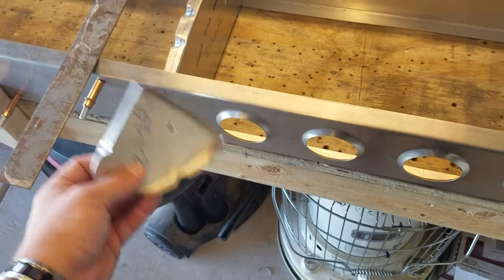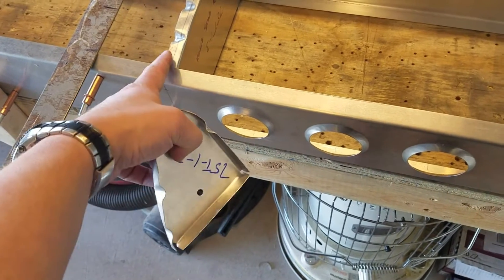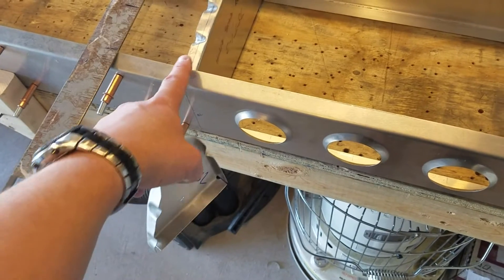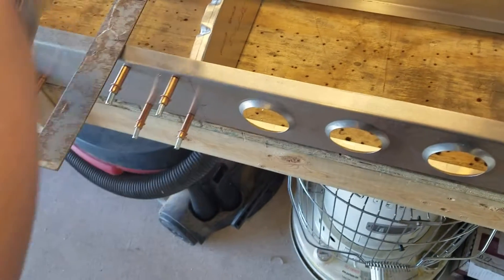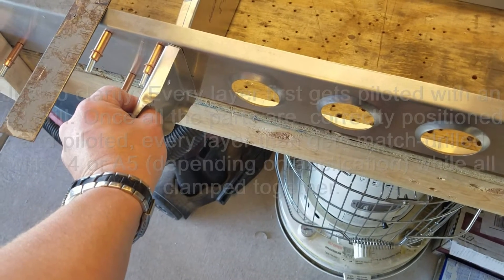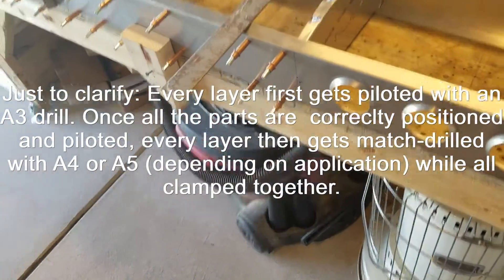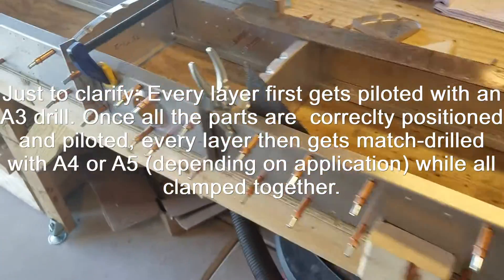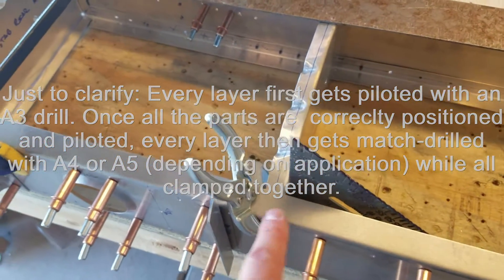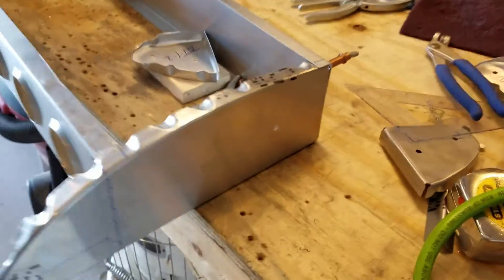Make sure that if you've got one, two, three, or four layers of material to drill through - and in this case there's four, remember there's a spar and a spar doubler - those were drilled initially with the A3 hole. I'm going to use that A3 hole to pilot this, then take everything apart, take the rear spar off, and do the final match drilling with the A4 for the nose rib. Just another tip there on setting these up: be very careful, don't forget to adjust any sight lines once you've got it squared up, and double check everything before you drill those holes.